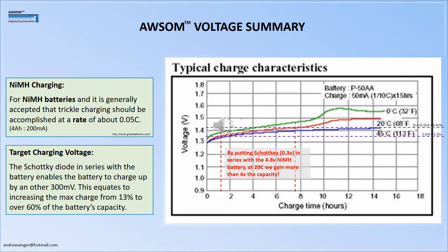The aim here was to trickle charge the nickel metal hydride batteries. It's not recommended, but there's no other way around it at the moment. The recommended trickle charge rate is about 0.05C; with 4 ampere-hour batteries that equals 200 milliamps. However the solar cells can only give 200 milliamps total — 100 milliamps each — in bright sunlight, so it's doubtful they'll ever reach maximum trickle charge. Without 6 volt solar cells, the battery would never even reach 13–20% of its total charge, so 6 volt cells are essential. Asymptotic charging techniques mean it would never fully reach target at 5.5V, but 6 volts generally keeps it well sustained.